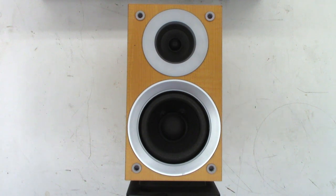Because if you don't hear sound out of one, it's a possibility it has a shorted voice coil. If it has a shorted voice coil, that's effectively a dead short into the amplifier — it's just like crossing the leads positive to negative, and it can actually do damage to your amplifier.